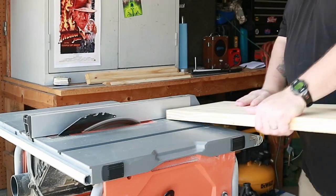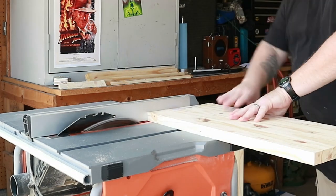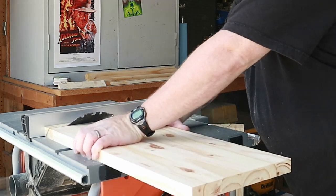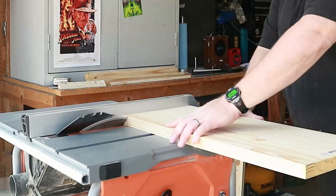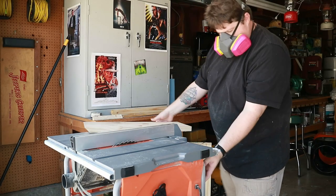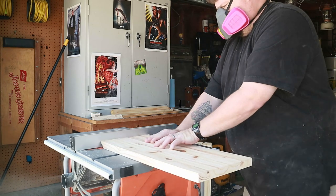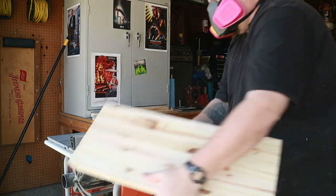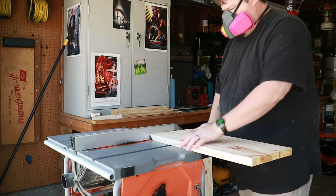The spline will slide into a groove cut in each mitered corner and strengthen the glue joint while adding a nice decorative touch. I don't have footage of cutting the splines but I did it on my table saw and it took a lot of trial and error getting them to just the right thickness. To achieve the mitered corners I set the rip fence right up next to the blade, set the blade to 45 degrees, and make the cut on both ends of the top and one end of each leg. Once the mitered cuts are made I cut the channels for the splines by removing the riving knife, flipping each board over, and lowering the blade. I kind of eyeballed it and the channels ended up just a touch deeper than I'd have liked, but they still turned out nice.